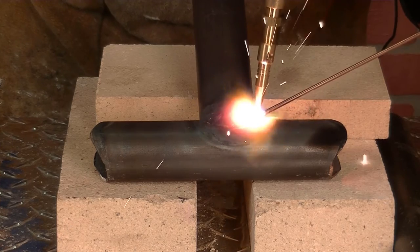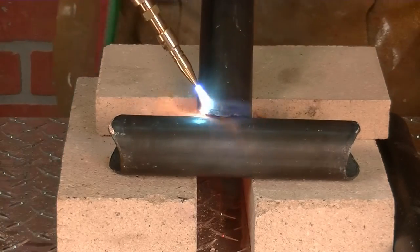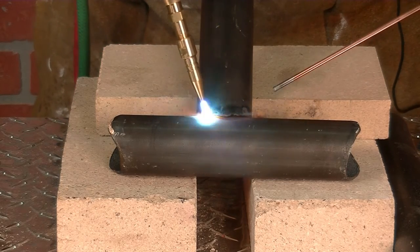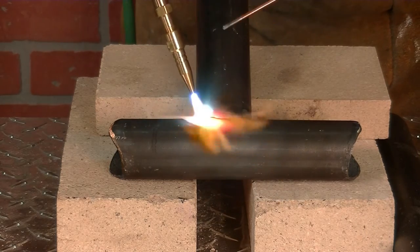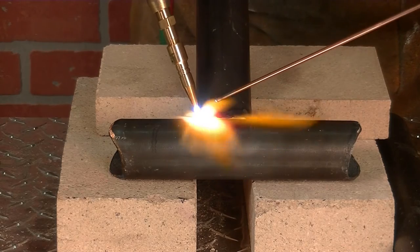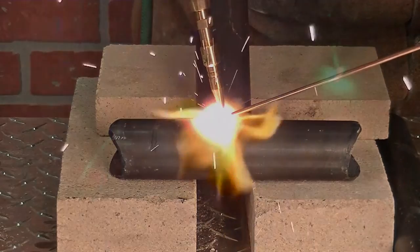Again, I'm concentrating on the very bottom round full tube and not the end cut because that's going to melt faster. Let's turn it over and do another weld on this side. Let's knock the chill out of it and start welding up again. That .083 thickness is lighter and it can be used as your roll bar or roll cage material. If you're using standard cold roll steel pipe you have to go a thicker wall to get the strength, and obviously you gain weight.